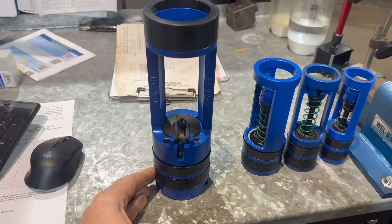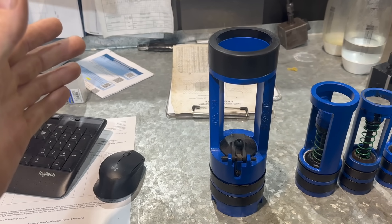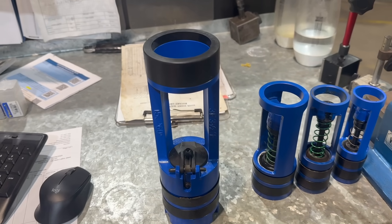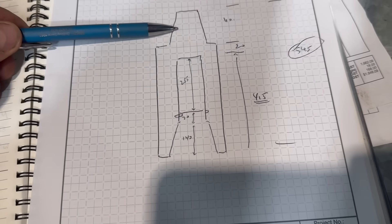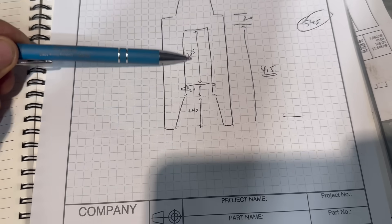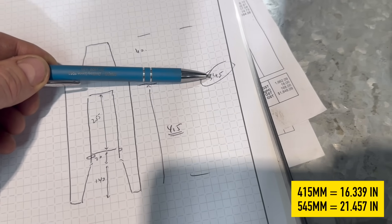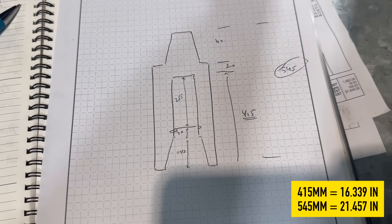On the channel — I'll link in the description — we've made a larger one of these which was really full on. This is a bit simpler but it's still a pretty big one. So this is roughly what we're building: two connections, box and a pin. We've got a deep drill, 415mm in, so the overall length of this is going to be 545mm. I've just got to give the billet a little cut down in the saw and then in the lathe.